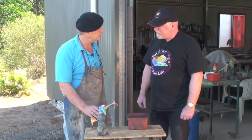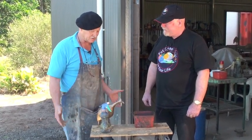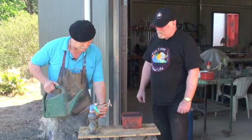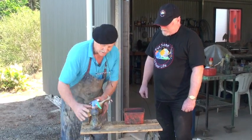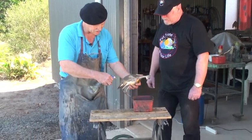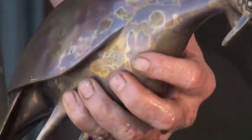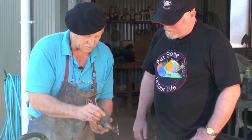Okay, I first of all put on a base patina, Graham. I use potassium sulphide — you can use caustic. There's lots of ways of making a base patina. So I've prepared a piece here for you, and I just wet it so it's nice and wet all over. Then I spray it with a chemical. There we go. So you can see the colour changing. Oh yes, look at that. That looks good.